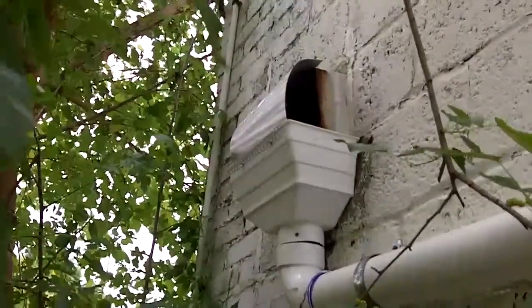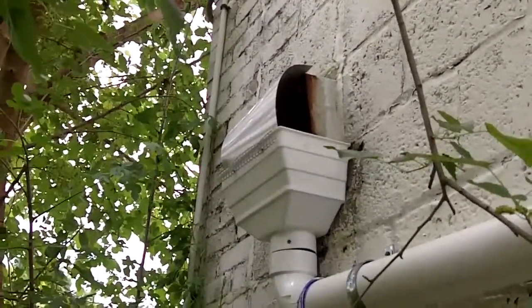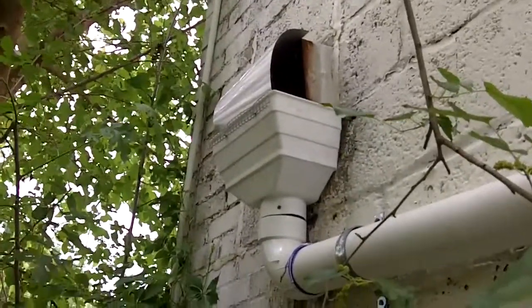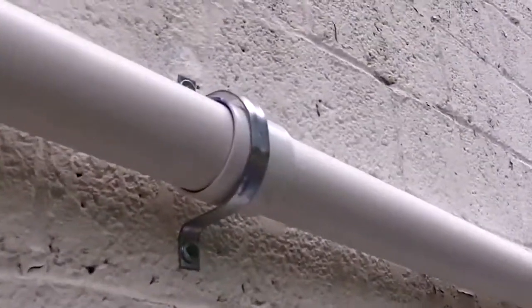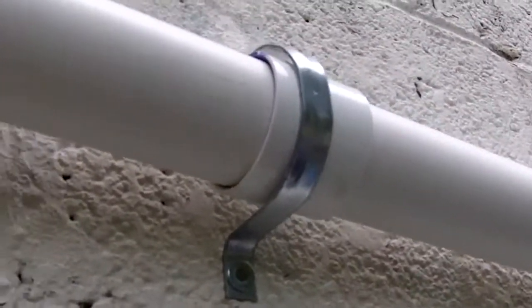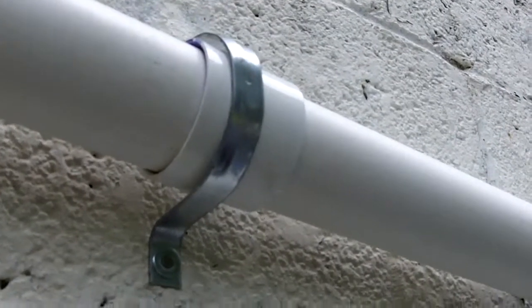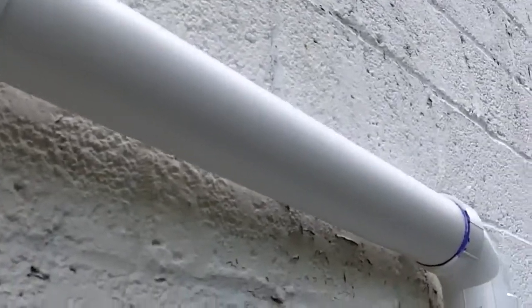The basket filter has a filter inside of it. And there's a diverter at the top that's made out of aluminum flashing, because what we find is during big rains it overshoots that basket filter. So the water flows along here, and we've got good three-inch pipe straps on the side. We use a type of PVC piping that is not intended for pressure — it's cheaper and there's no reason to use schedule 40 pressure pipe. This is actually drain pipe that is not meant for pressure.